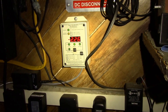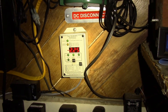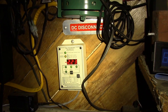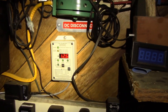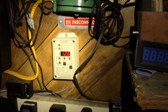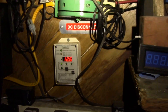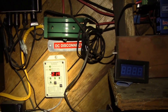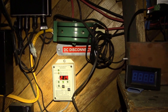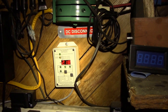It's pretty much stabilized — 3.1 amps. It was 5.37, now it's about 2.25, so that's a little over 3 amps — 3.15 amps. The voltage is at 12.6 volts, so pretty close to the advertised power on those bulbs. Running about 39 watts at 12.6 volts and just over 3 amps — maybe 3.2 amps. That's my capacitor soaking up the difference.